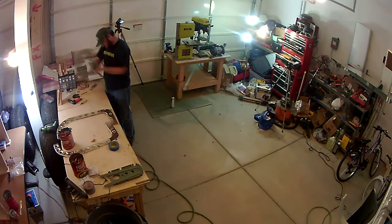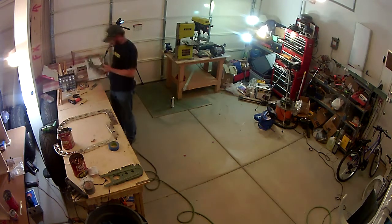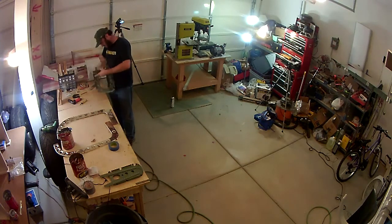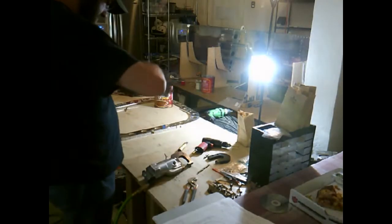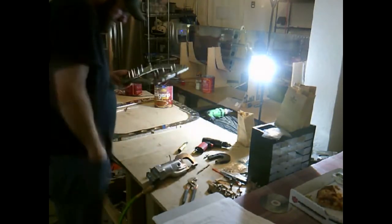The large bulkhead that you see there, you actually only put one rivet in the top portion. There is a rib, or a stiffener essentially, that goes along the top skin that will attach to the other three holes on the top of that bulkhead there. But the rest of this process is pretty straightforward.